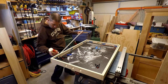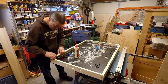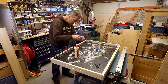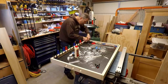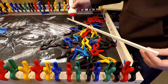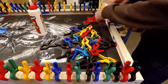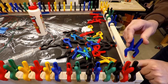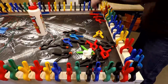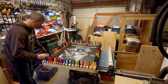The clear acrylic pieces that actually hold the poster in place are held in the frame with retaining pieces that run around the outside of the front of the frame. These are just matching pieces of poplar that are three-eighths of an inch wide. I glued the retaining strips on the sides of the poster frame first, then I measured and cut and glued the pieces on the top and the bottom. Make sure that when you glue the retaining strips in place that you have them flush with the front of the poster frame. This will help it look more uniform and make the finishing much easier.